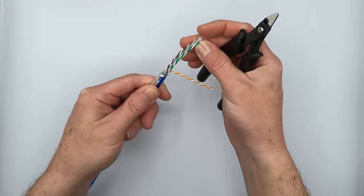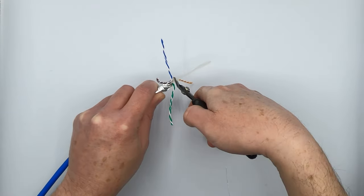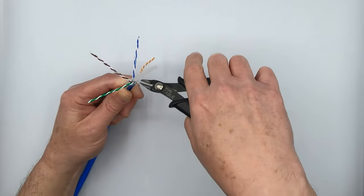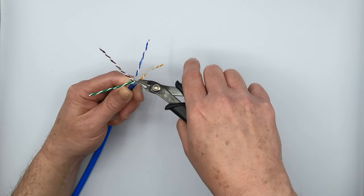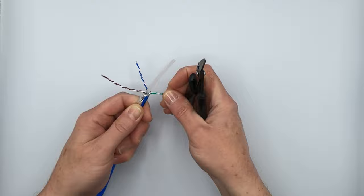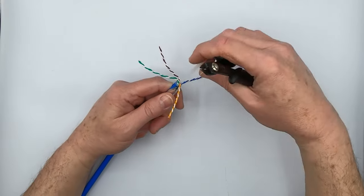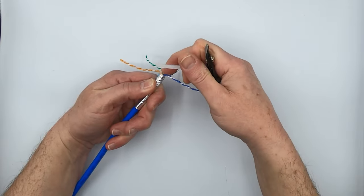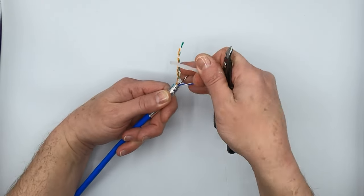When you're removing the spline on this cable, the best thing to do in general with a spline is don't cut straight across — you're going to leave too much of the spline left over. Fold your conductors into a star pattern, and then you'll have four wings on the spline that you need to snip. Rest your clippers on your cable jacket at a downward angle and clip each wing. Once you've got your spline wings all clipped, it's just a simple matter of twisting and it removes. It leaves a very nice removal — no excess spline sticking up, which is going to help greatly with putting on a plug.